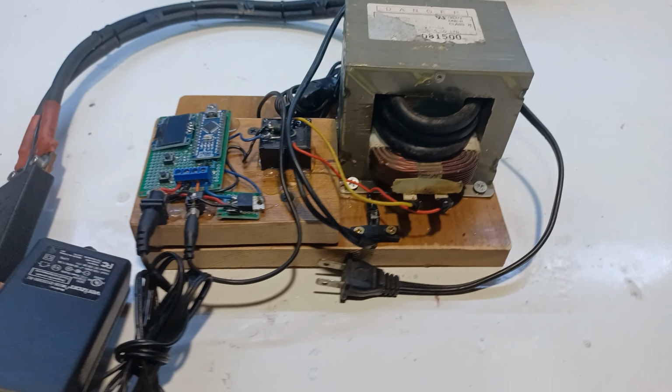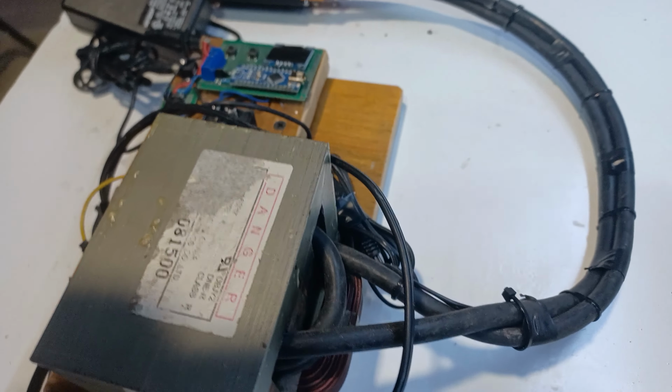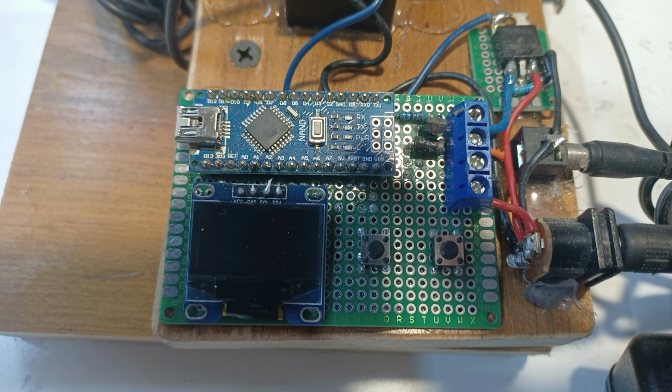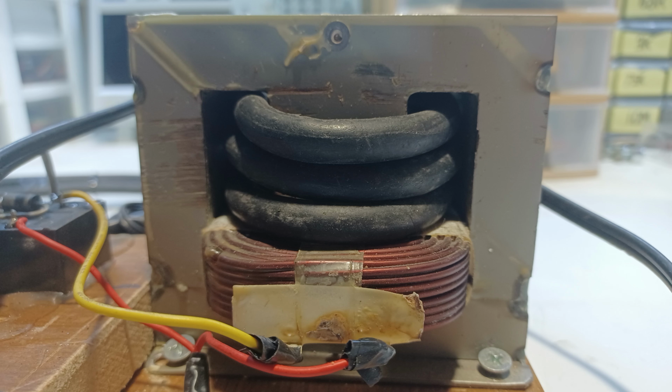In order to be able to weld the series or parallel connection, I made a spot welder. The spot welder relies on an Arduino Nano, which turns on a MOSFET that turns on a relay and then turns on a 100:3 transformer for a set amount of time.